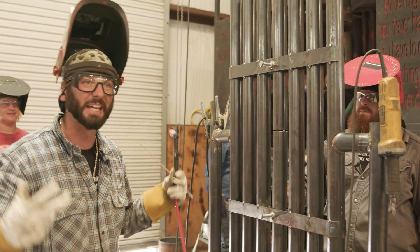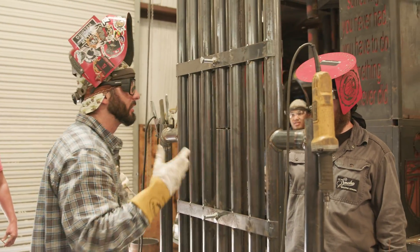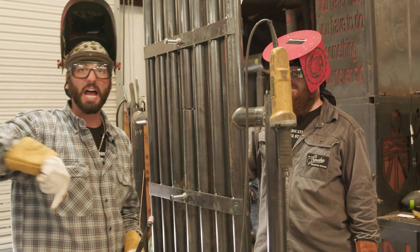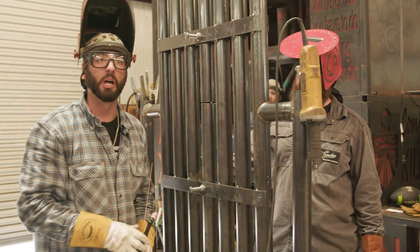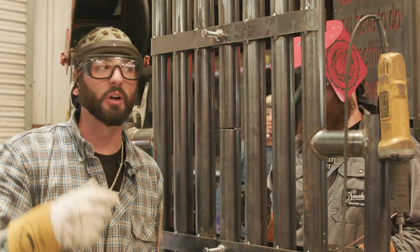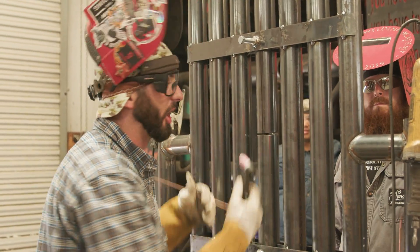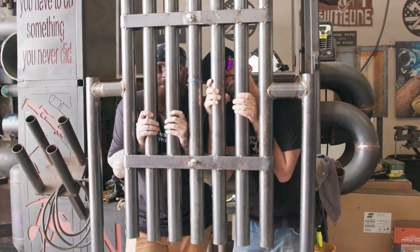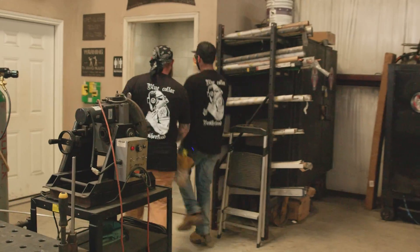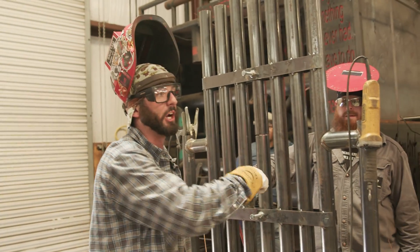On boiler tubes and water walls, getting inside power plants — there's going to be a tight spot. There's no way to make this weld quickly and efficiently if I had to get out of the boiler and come back around, so it's going to be a partner on the other side. Some of the stuff is still the same: communicating when you're grinding, when you're lighting up. You're typically going to be running a die grinder in these tight spots, and our arcs are going to be really close to one another. Wherever he goes, I go — he's got to go to the bathroom, I go.